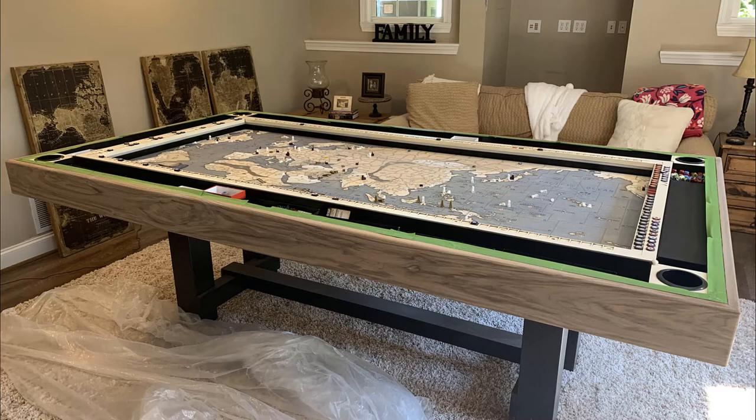So then, basically, 3 months have gone by, and I re-sanded it again, taking it down to 100, then up to 120, 150, 180, 220, and here is where we're at. And I am ready to stain this thing, and I am going to let the stain sit there for 1, 2, 3 months. I don't care, because I'm not re-staining this thing again.